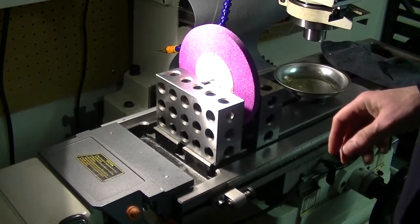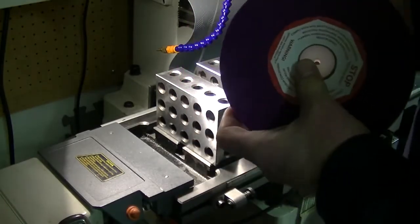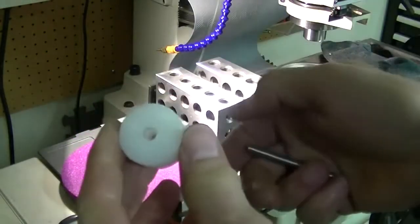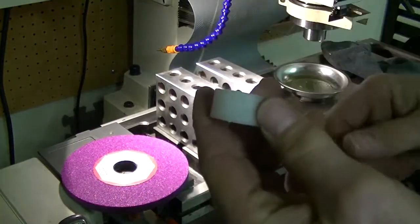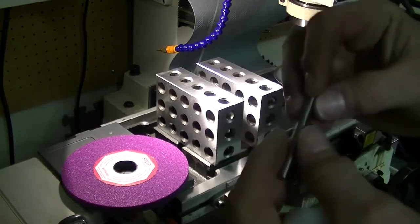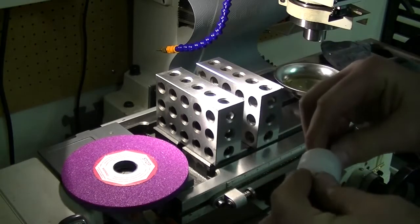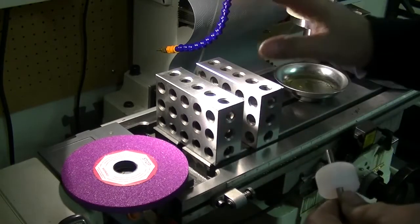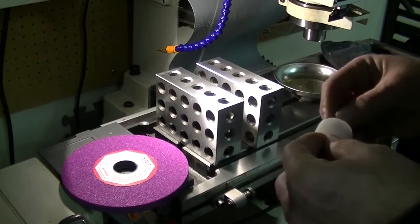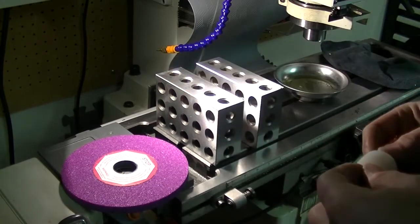I just want to show quickly what I did here. On the lathe I machined a plastic bushing that fits inside the grinding wheel, and I also machined a pin. I polished it and it fits nicely inside there. The big deal is that you have to have something that's really, really level. So I went around the shop with a Starrett machinist level and this corner of the milling machine turned out to be really quite level.